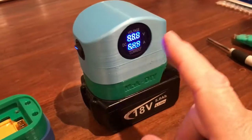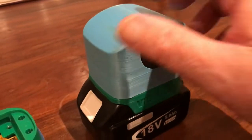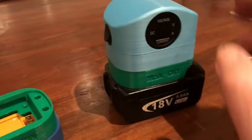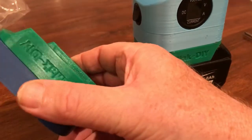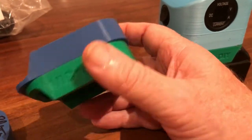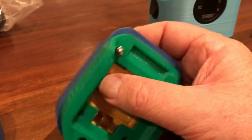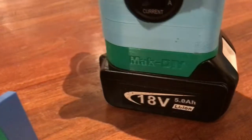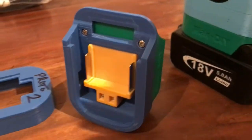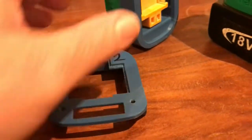I've been playing around with Makita battery-powered items. This was a little power supply with a switch on the end that lights up and a volt-amp meter that can supply power to a cigarette lighter type adapter — that was my first attempt at a Makita battery-powered item. I moved on from that, bought a green base from a company in Victoria called Vic Tools, and from that thought — rather than buying that in, I should look at printing my own. I got a design from Thingiverse but didn't much like it, as it overhangs the green battery base all around. So I thought if I could emulate that fit in my print, I modified the Thingiverse design to come up with my own shoe base which fits a lot better than that original one.